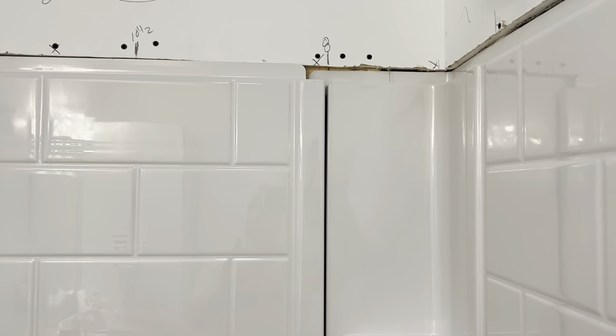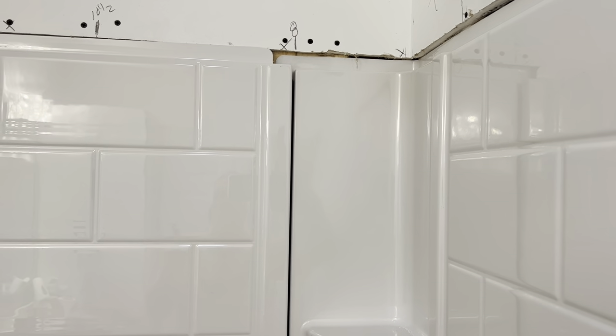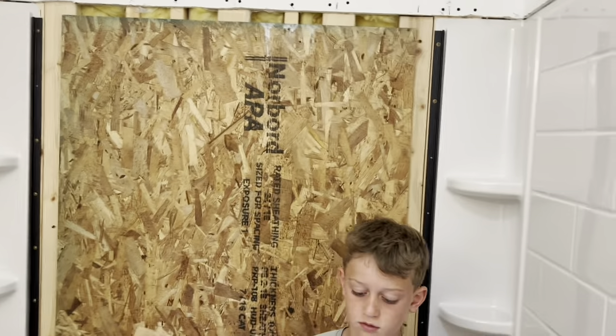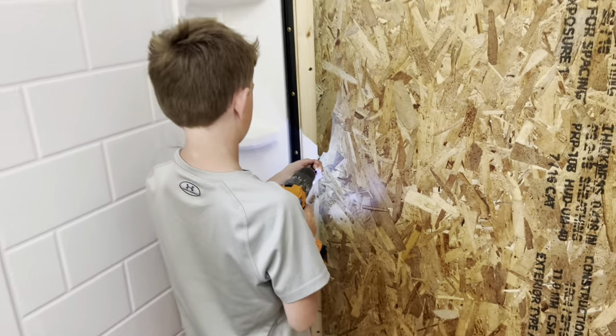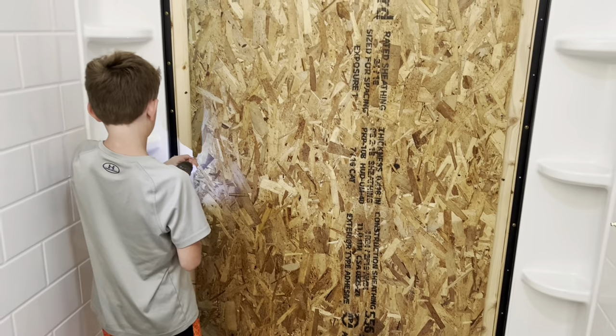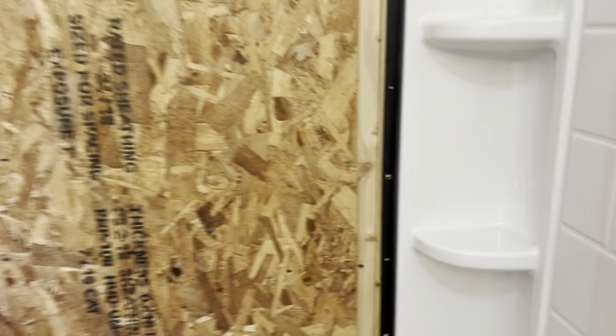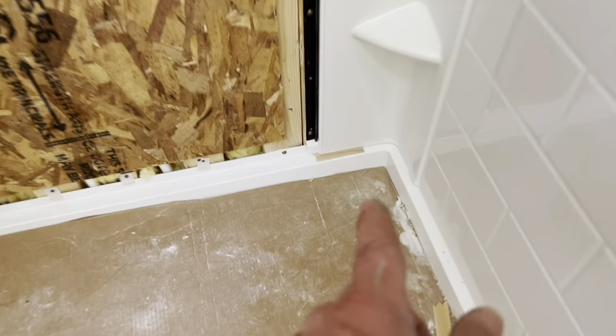I've got a gap, but the nice thing is it's a uniform gap. All we have to do is bump out each side just a fraction - I'd call it about a quarter inch gap, so we'll shim out an eighth of an inch on each side and we're home free. Jackson's going to put in some final screws in the OSB - you can see the studs right here, put a screw right here. The final sheet of OSB is on. We did have to adjust the connector strips - it was a little off, but I slipped a small shim under there, brought it up just a little bit to balance it out and make it flush at the top.